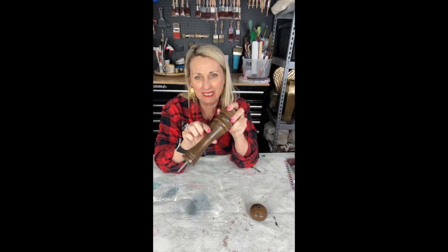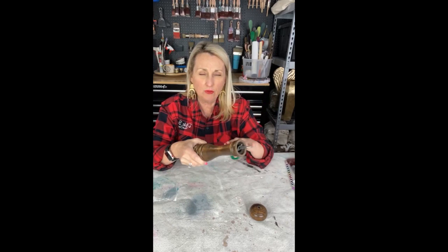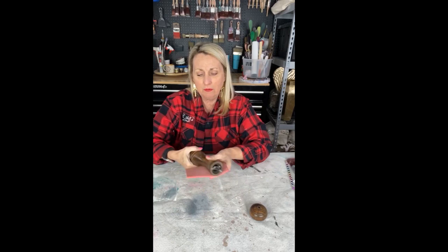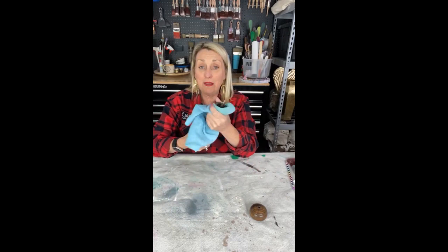You really don't need to sand this — it's got a pretty good little tooth on it anyway. But with the silk paints, they say you need to do a scuff coat, just scuff it up a little bit. I'm going to use their surf prep pads, very fine, and just run this over it to de-gloss it slightly. You don't want to sand down into the wood grain or see raw wood. I'm just using a microfiber rag to take the dust off — you can use a baby wipe if you want.